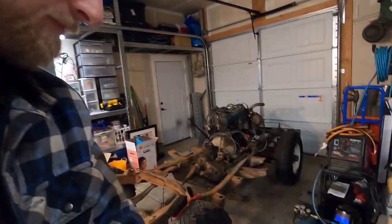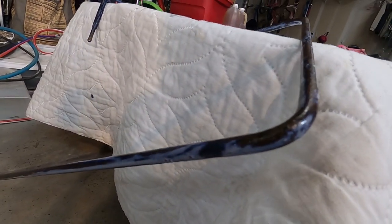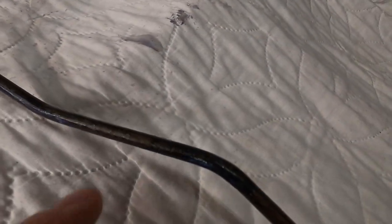The nice thing is I poured some in that cup — it doesn't go bad quickly and the brush doesn't dry up very quickly either, so you don't have to keep cleaning brushes between coats. Just keep the same brush and a little bit in the cup. We're ready for coat two now. You can see some spots still a little white but you can see it turn into that purple. The spots where it's set in are a really dark brown, and every coat we put on will get darker and darker till it's almost black. Three, maybe four coats is just about right.